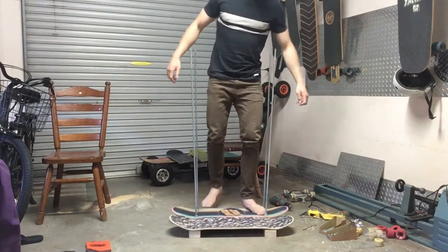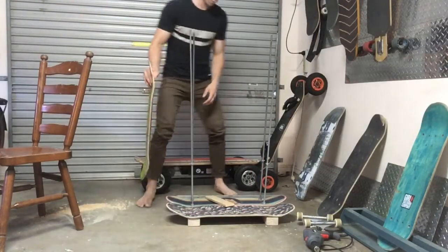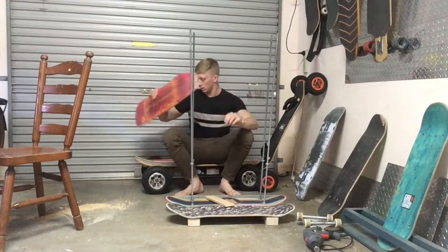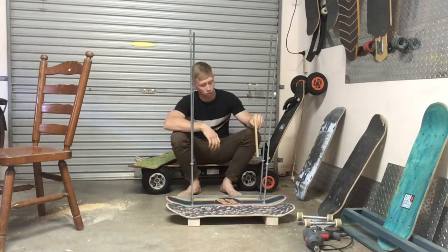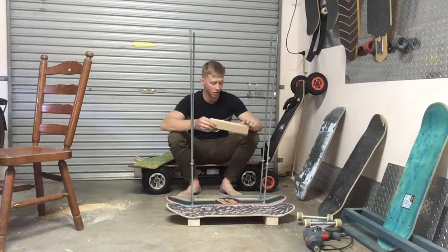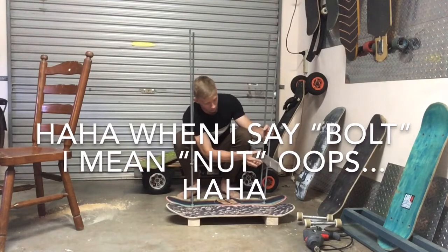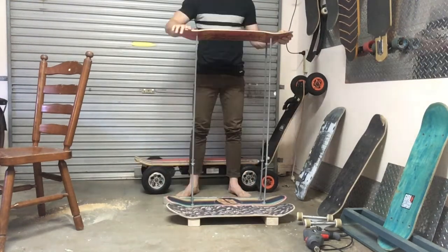Yeah. Stack the decks up now. Okay, sweet. So my first skate deck is about to go on for the next part of the shelf. It's a good idea to get a piece of timber cut to the length at which you want in between your shelves to be. Mine's about 27.5 centimeters, and also maybe grab a level to make sure your bolts are sitting roughly level, sort of thing. Let's put this deck on.